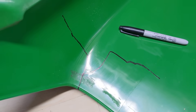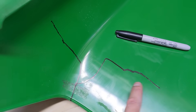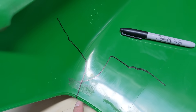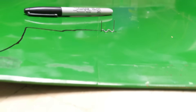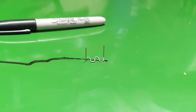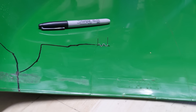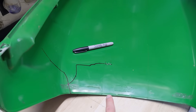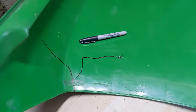In this case I'm not going to drill holes into the plastic, but I will start hot stapling near the ends of the cracks. Before heating things up, you should have a rough idea of how thick your plastic is because ideally you want to sink the staple about halfway to really increase structural integrity. If you just do it on the surface they can pop out, and if you press too hard it could go right through.